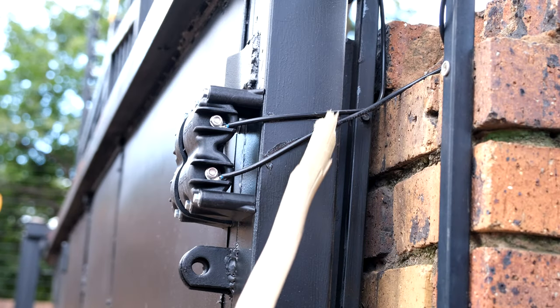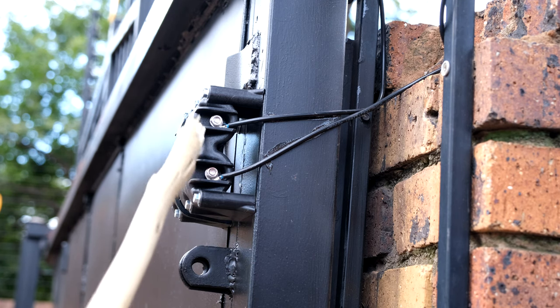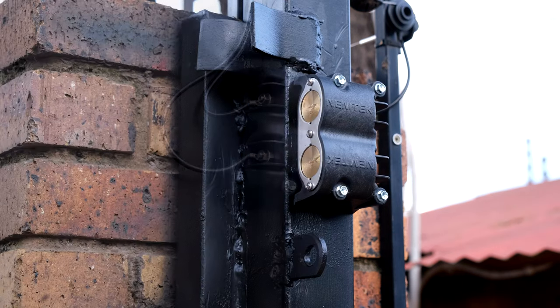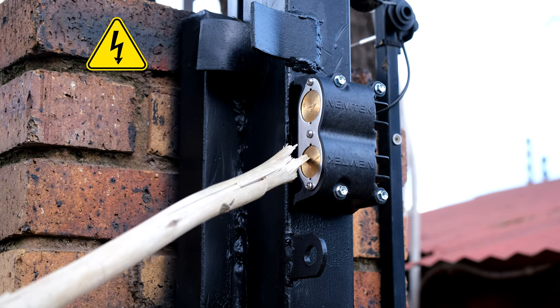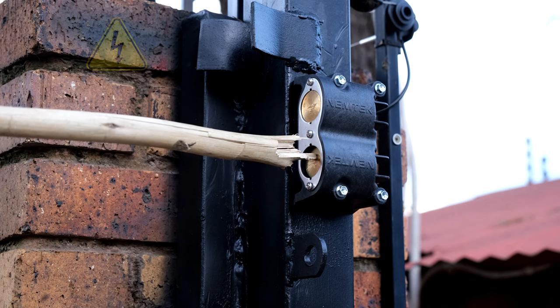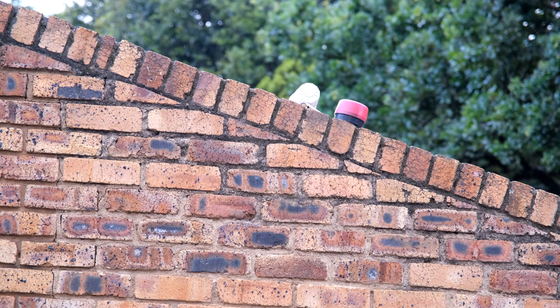These two wires are coming from your fence. All you need to do is open one of the lines on your fence - any live wire - and just open it, run it here, and the return goes to the other side of that line you opened. When I open the gate and the electric fence is still on, if I press this in, the electric fence should actually activate the alarm. And there you can see my electric fence light is activated, telling me an alarm has occurred.